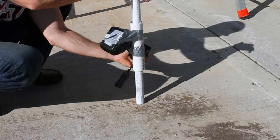The red Makita definitely performs better, but are the tool internals basically the same, or are they quite a bit different? The blue Makita bearing on the back of the motor makes quite a bit more noise than the red Makita. From a distance, the internals look a lot alike, but there's actually quite a bit of difference. The connector and switch are definitely not interchangeable.